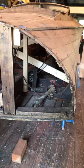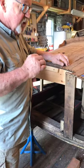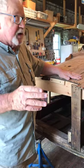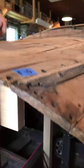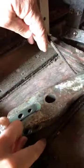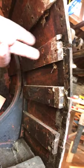Another very unique part is the construction methods indicate that there was an overall desire to have a very lightweight hull. So for instance, you can't see, but there's no battens under these planks. There's nothing between here. And you can see that there is in the bottom. So this battens, and also look at all the rivets. But look at all the pairs that are between the frames. And out here, between the frames, there's another three pair of fastenings from the inside out.